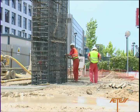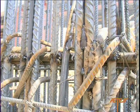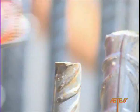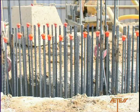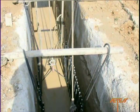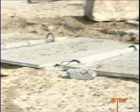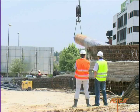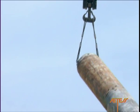If they have not already been put in place during assembly, separators will be introduced successively as the frame is lowered. If the frame ends up at a height above the work platform, then plastic caps should be placed on the ends of the vertical bars. If it comes below the platform, then the trench should be covered again with tramex boards. When installing the joints, the same recommendations that apply to the frames should be followed.